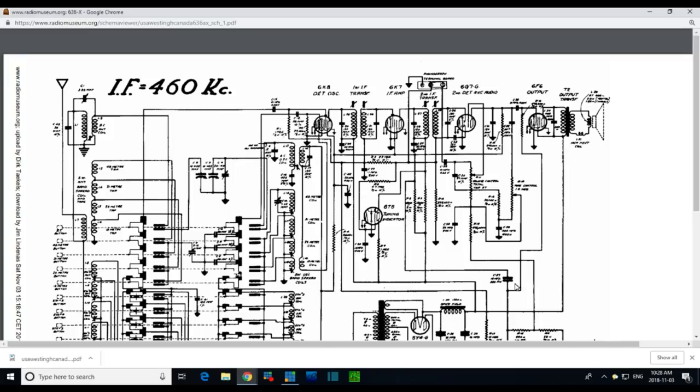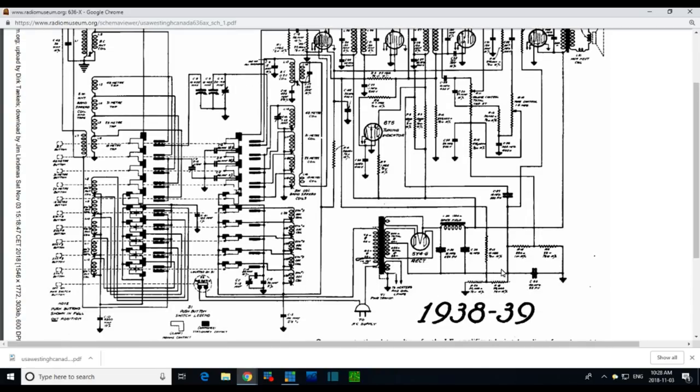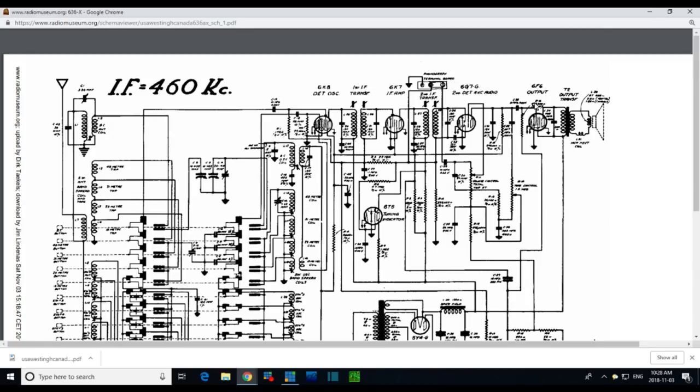So what that implicates is not much down here actually, because this is tied directly. It implicates this capacitor, that's for sure. This capacitor can be leaky, and there's a fairly high B plus here, probably 250 volts, pushing on this capacitor. A few electrons sneak through and collect in this big resistor. This is a big one, I'm sure. I can't read it there, but I'm sure this is a megohm or something like that. So pressure will build on this side.